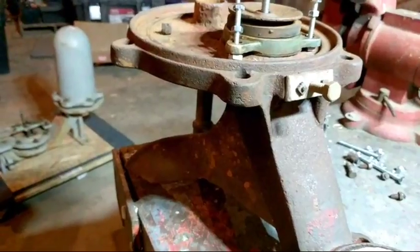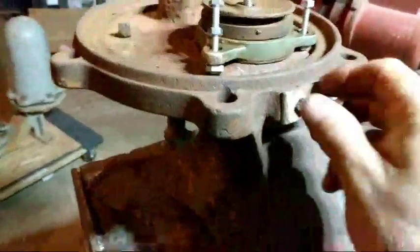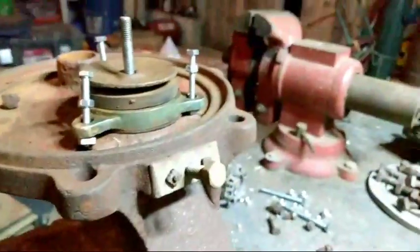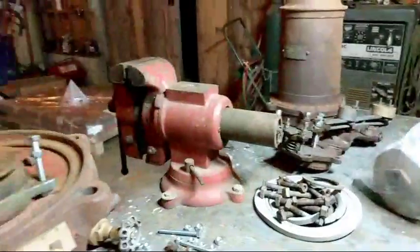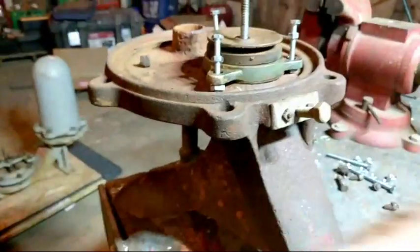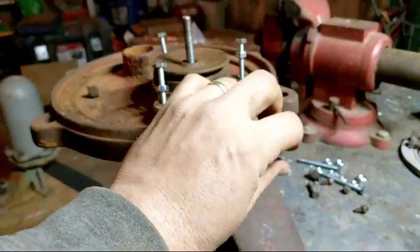All right, just looking at some of the comments here. What is the snifter? Okay, snifter, I can answer that. A snifter is basically a place that acts like a venturi on every stroke of the ram. It sucks air into this chamber, which you see a chamber down there, one over there. And you'll see it spitting out water on every stroke. But what you don't see, for all the water that you spit out, it also sucks in air like a venturi. When the water goes by it, it sucks air in through it. So it's a little orifice. And this thing's adjustable. It's got a little cone and a little seat. And it keeps the ram from getting waterlogged.